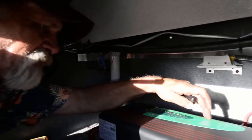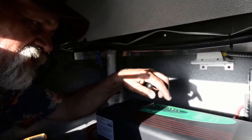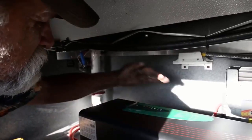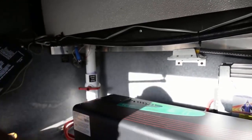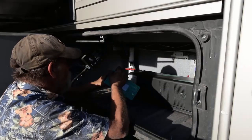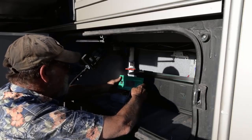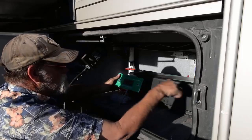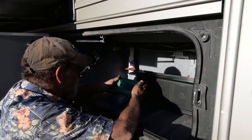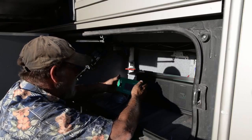We just set the battery type for the unit. The charging portion needs to know what type of battery and it sets up basically by amperage. The unit is live — green light, we are good. Now we're going to go up on the roof, plug the panels in, plug the monitor in, and read the monitor to see what everything is doing. The unit is on and running. The solar panels on the roof are all plugged in and producing power to the inverter, charging the battery system and producing AC power for the house.